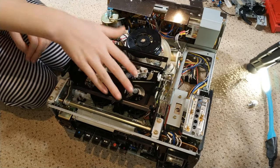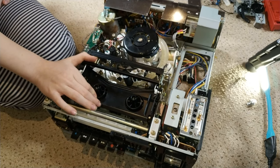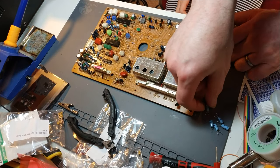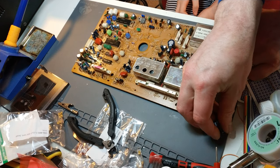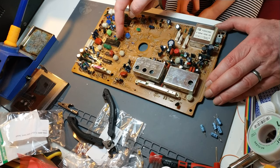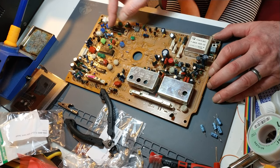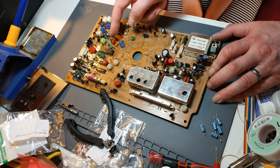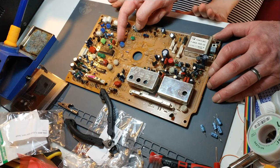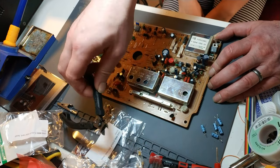Let's crack on with getting it back together, then we'll do the capacitors and give it a try. I ran out of room on the camera. In the meantime, we've done some more capacitors. This one was 0.68 — what I've done is tacked together a 0.22 and a 0.47 microfarad capacitor, which makes 0.69. That's fine — I can't see any real problem.